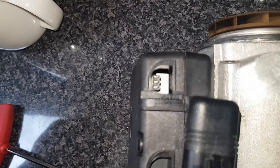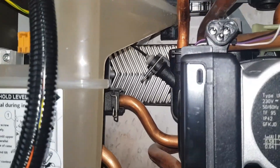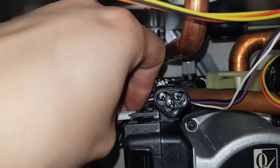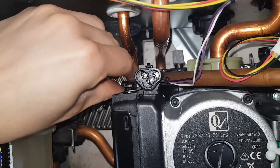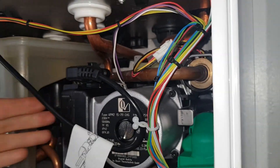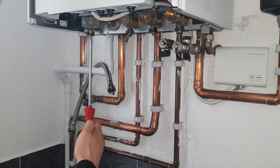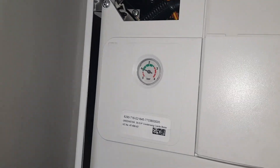We're going to put this plug in first — that's a plan view, you can see where it goes onto the PCB inside the pump. It's going to slide on that way — just took that back off, a bit fiddly but it will go — there it goes. Just put that one on now — that's it. It's got the isolation valve now — that's it. Just put a little bit more in — one point three on the gauge. A bit more — you'll probably lose a bit through elsewhere, but yeah, just do it slow. Give it a bit more angle, make sure there's no water there.